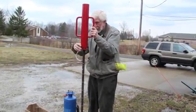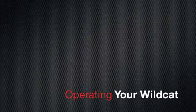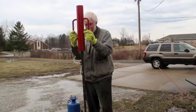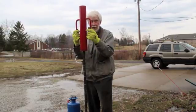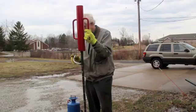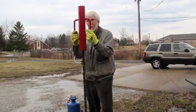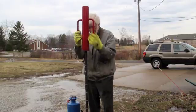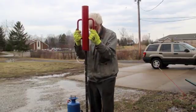We're all set up to start. Now we're going to drive the first three intervals of 10 centimeters without hooking the slurry up to the slurry tank. I'll count these blows and then note them on the field record at the end of three intervals.